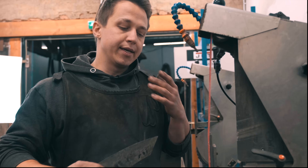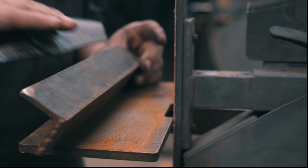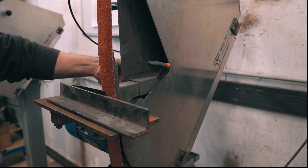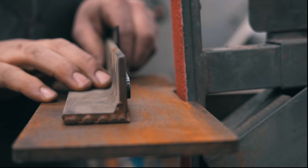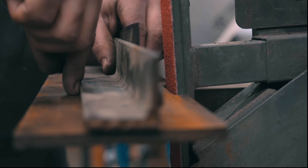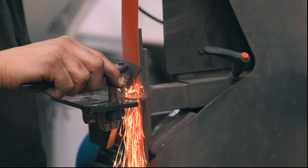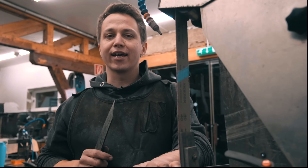The next technique I would like to mention is some form of a guided angle. You could clamp your knife on the grinder, for example, at a 90-degree angle to some angle iron. I have a small support in the back — just a piece of sheet metal welded to the bottom — and I could clamp my knife there so it's in exactly 90 degrees to the work rest. On this grinder I have the freedom to adjust the angle. If you don't have that possibility, you can get one of the grinding jigs that do this for you. TR Maker makes one, or you can make one yourself with a larger angle iron and a screw that adjusts the angle. You can always use an angle measurement device to check what angle you're at. That way you can get very even angles and go for a specific angle that fits the performance you're looking for. This will be much easier for beginners — it's one of the techniques I teach in bladesmithing classes because even on your first knife you will usually get a pretty good result.